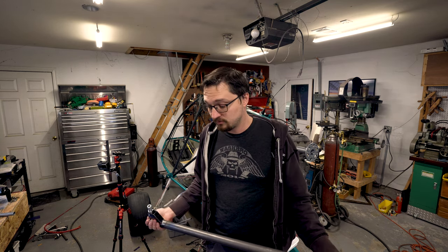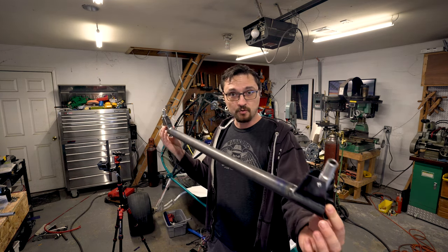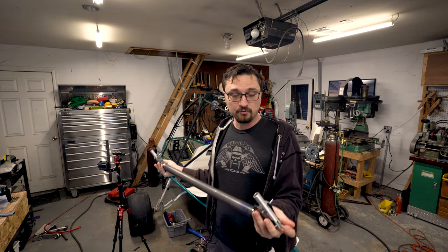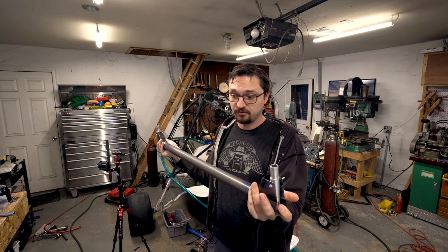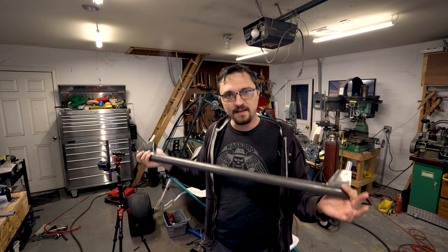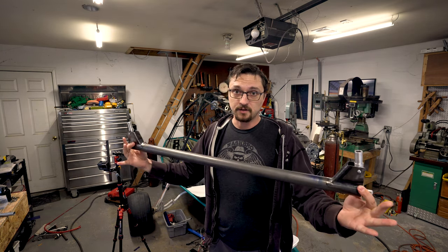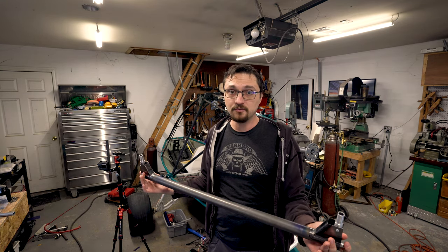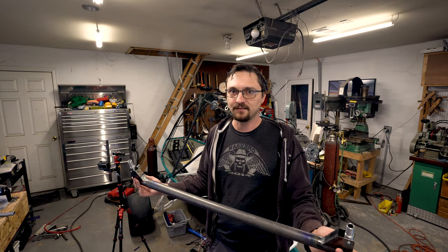There's also going to be some other challenges getting control cables off of this, because this is going to drive ailerons via something that doesn't exist yet here, and going to drive the elevator with pull-pull cables, which also aren't here yet. They're in the airplane. So we have some stuff ahead of us to do. First things first, we're going to take it a step at a time. We're going to go ahead and build the mounts to actually get this in the airplane. Then we're going to build onto those mounts to secure it and to get the controls off of it. So let's get started on that.